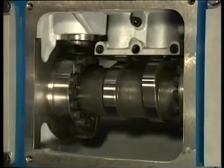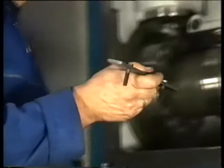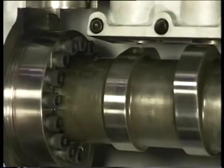Turn the engine into scavenging top position. In this position it is easy to mount the locking strip to the guide bushes, which keeps the inlet as well as the exhaust roller in an upper position so that these rollers become free from the cams too.